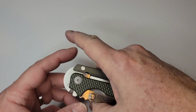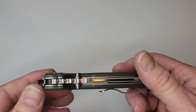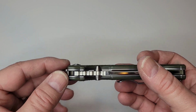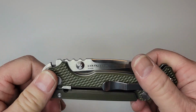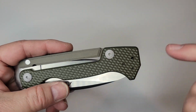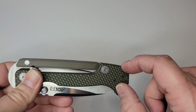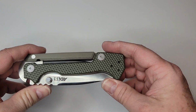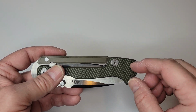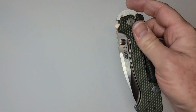Oh yes, this is great. One thing to watch out for when you do this is this knife. I thought it was just going to be pure phosphor bronze, but it does have a Teflon washer next to the knife in between the phosphor bronze washers. They're super, super thin, so don't lose sight of those. Also watch out for your back spring. The back spring's back here, and as you lift up on that, it's compressed right there. You're going to need to take that out, and when you take that back spring off, it can go flying away. So watch very carefully on that back spring.